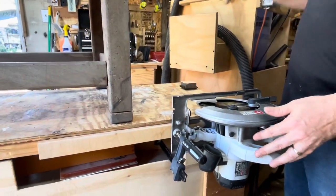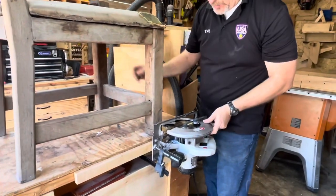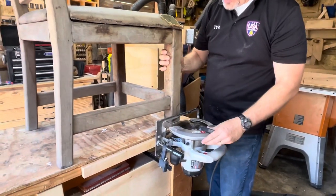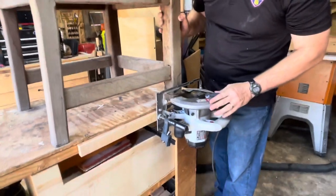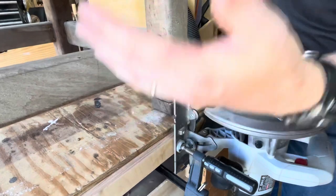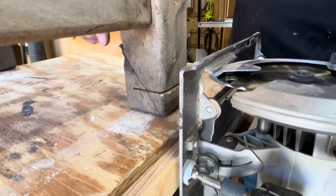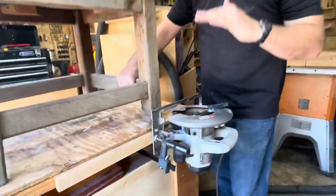And since this will do plunge cutting, I then move the chair over here, pull the saw back, move the chair, and cut each of the four legs going 90% through. Just leave that last little bit so that there will be no tilting, and then all four legs will be cut at the same height and it will be perfectly level.